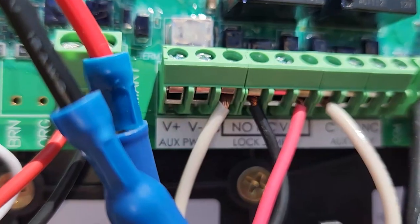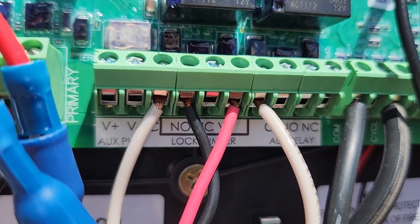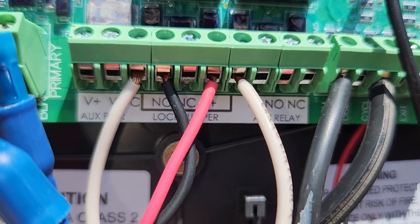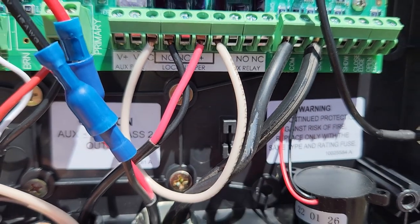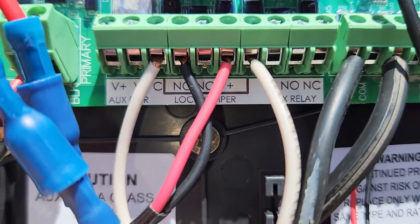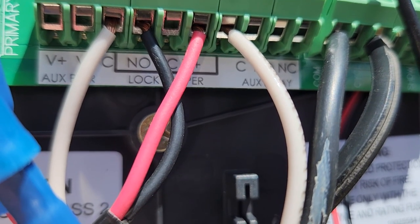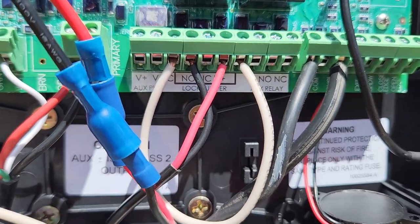The directions are pretty clear, but if you don't know what a jumper wire is, hopefully this will help. So this is the line coming in, already split off from the manufacturer. Our black wire — our negative — goes fourth from the left in the NO slot. Then we skip one and go sixth from the left with our positive wire in the V+ slot. So: black fourth from the left, red sixth from the left. Then you take a jumper wire — a small 14-gauge low voltage wire — strip both ends, and insert it third from the left in the C slot. Then loop it all the way over to seventh from the left into a blank slot.